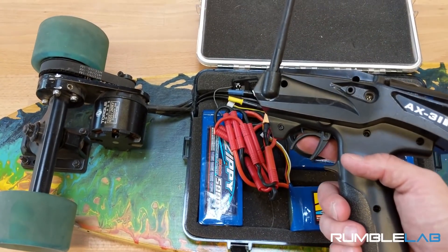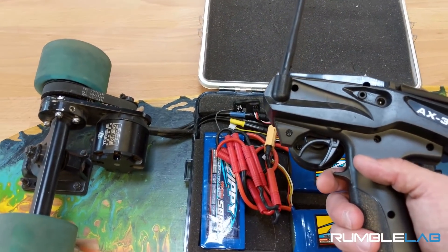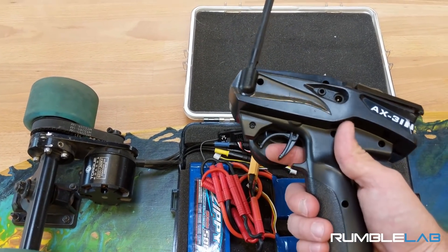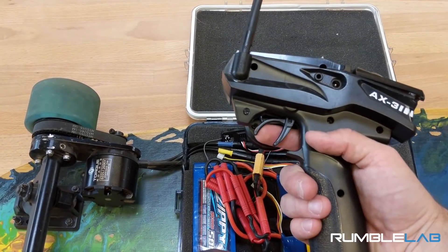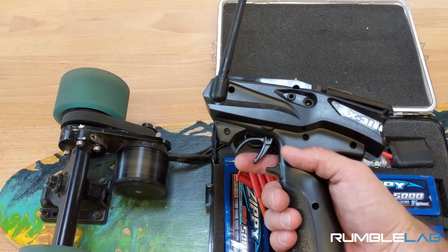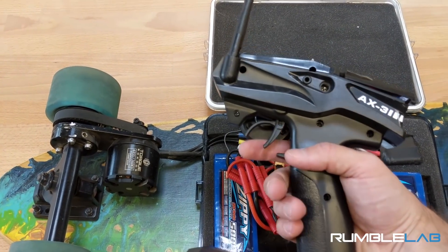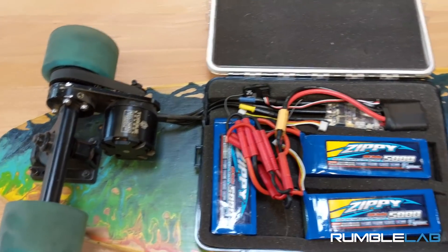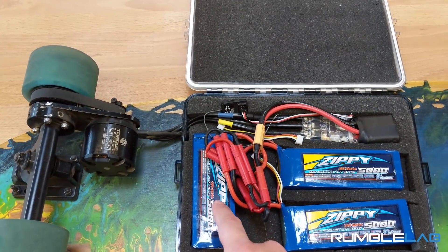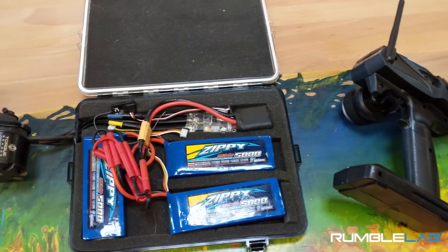Another interesting thing — on one of our projects, we make a hand crank generator, and we see that when you spin a motor, you can generate electricity. But whenever you generate that electricity, it makes the motor hard to turn. So for us, we have what we call regenerative braking. When you pull the trigger and let it coast, it'll slowly come to a stop. But if you push the trigger forward, it comes to a stop quickly. Basically, the speed controller starts generating electricity off of the motor, sending it back into the batteries, which causes the motor to stop relatively quickly. That's pretty much all there is to it — it's really quite simple.